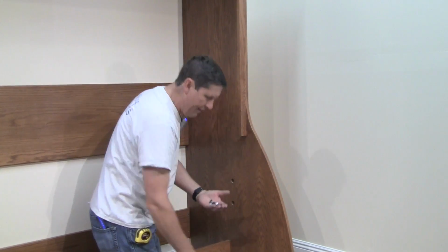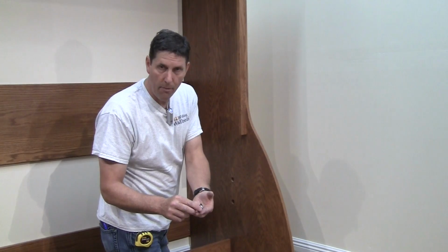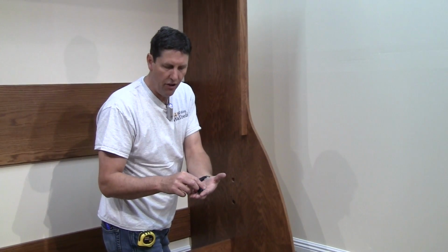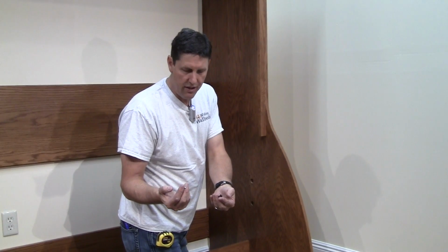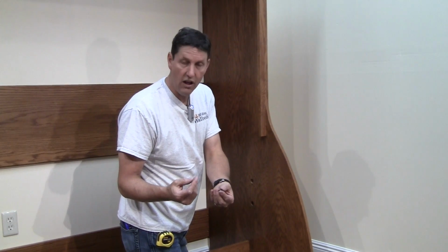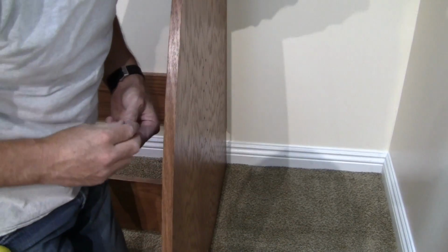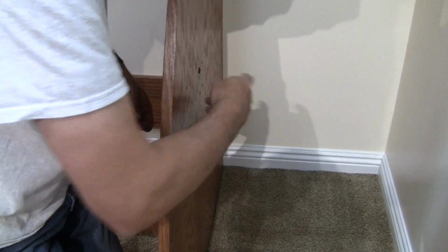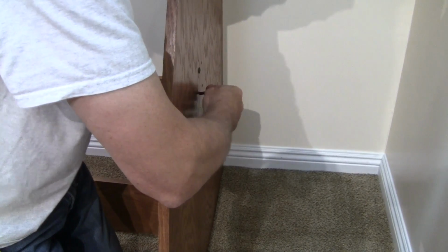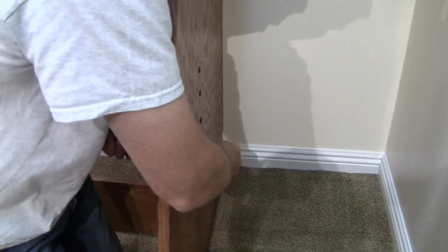But from the manila envelope that we provide, we're going to find some smaller barrel nuts. There's two sizes, smaller barrel nuts, and some 5/8 inch machine screws that will anchor this lifting arm in position. Now from the outside of the sideboard, you'll see a series of 8 holes here, and I'm just going to go ahead and put these barrel nuts through all 8 holes on both sideboards.